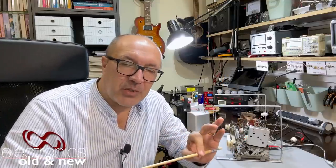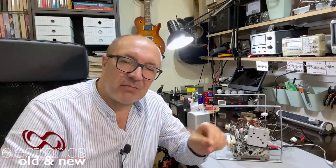I got to the stage where I basically needed to do the FM and the final cabinet restoration. My logic was easy: just get on with it, do the FM alignment, the RF alignment, check the IF alignment — which we very seldom need to worry about with FM on these radios, sometimes you do but very seldom — and just do a bit of cabinet work. There's not much to do. Put this in, test it, show them. Boring video — okay, that's what I had in mind.